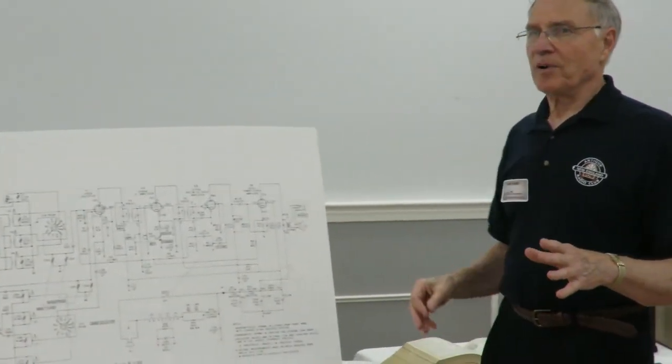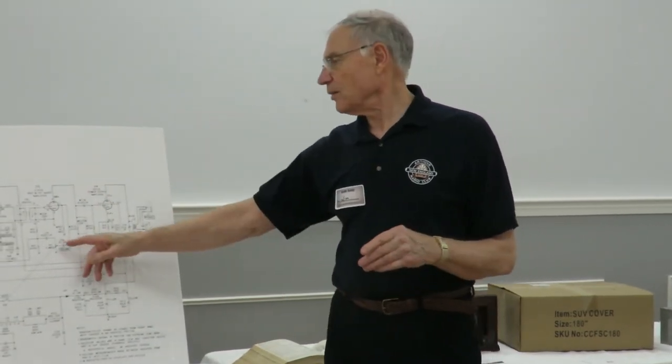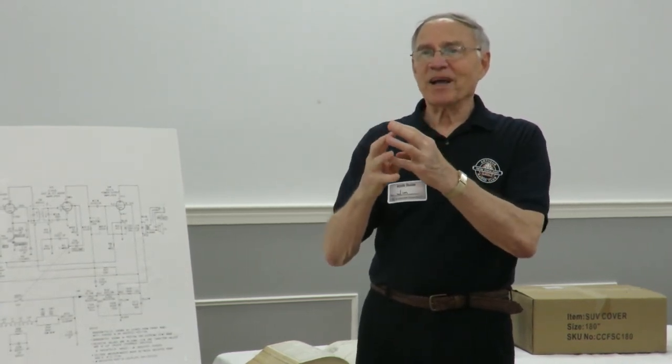Have you ever taken them apart? I've seen some. I've taken, that's a good point. I've taken them apart. I had one radio that came in, and the shaft was broken off. It was a control. The shaft is totally broken off. Well, now what do I do? Well, what I was able to do is I had exactly the right part. I was able to, without unsoldering the wires, open the thing up, put the new thing on, put all that together again, and you could not tell the radio had been worked on because nothing had been desoldered. So, I mean, that's the holy grail of solutions right there, is when you can take it apart, put a new one on, and get it back together again.